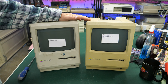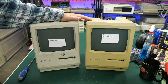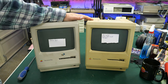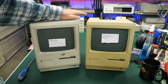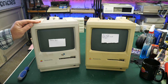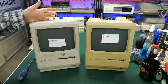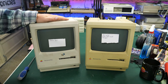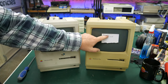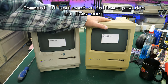I've got a project coming up and I need to get one of these working. When I went out to test the Macintosh Pluses I had on hand, none of them were actually working. This lighter-colored one had no signs of life at all. The other one had some crackling - labeled 'bad analog,' meaning bad analog board, perhaps broken traces, bad joints, or bad caps. So this lighter one doesn't boot at all - let's see what's going on.